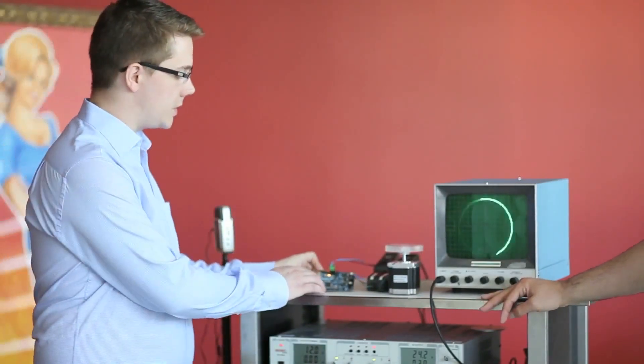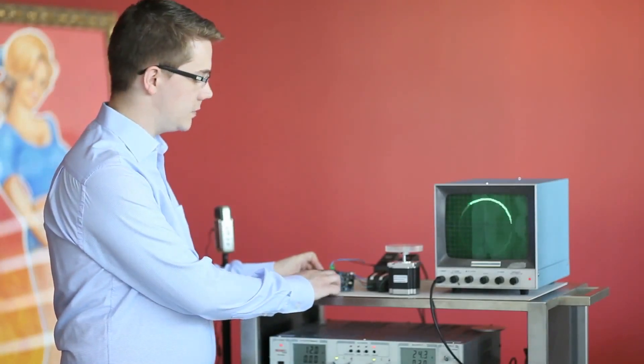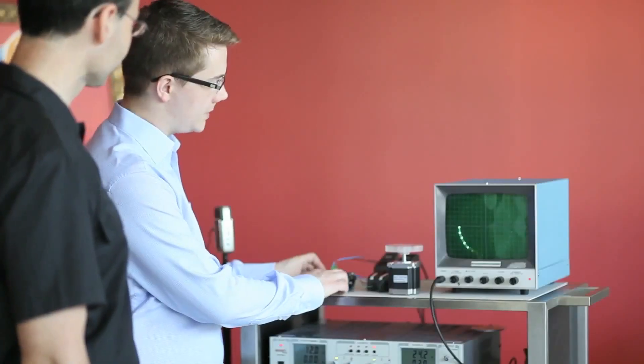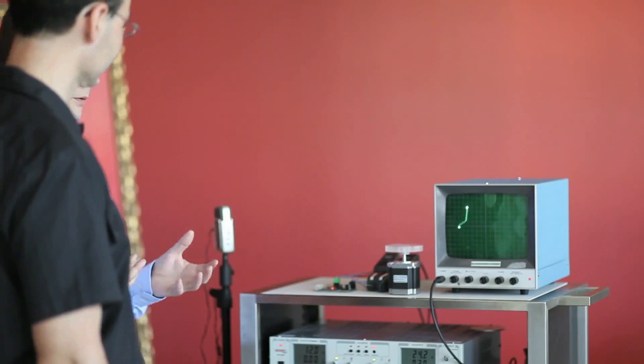All this technology is incorporated in the TMC-262, the high microstep resolution stepper motor driver on this board. With this we can achieve very fine current regulation, very high microstepping, and additionally very deep control, either via step/direction input or SPI.